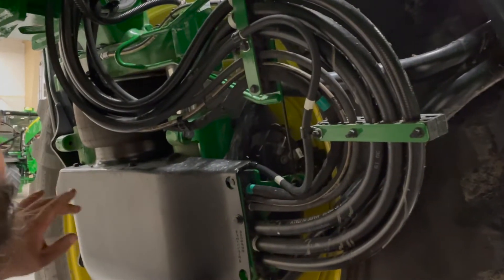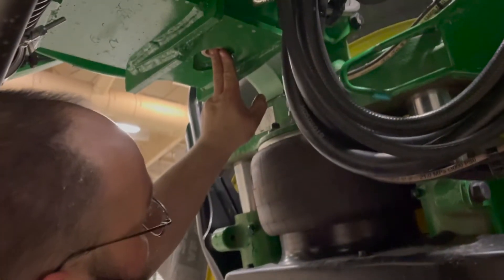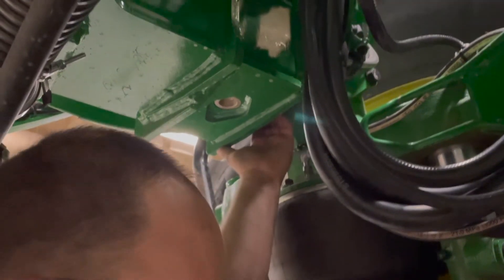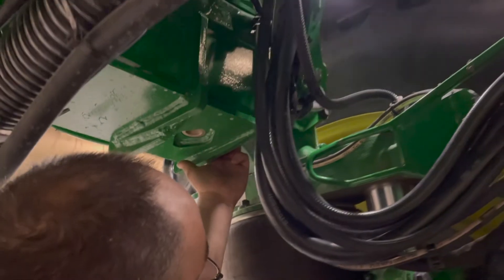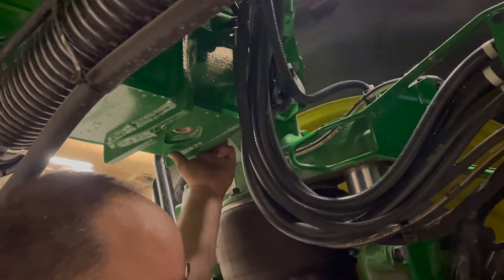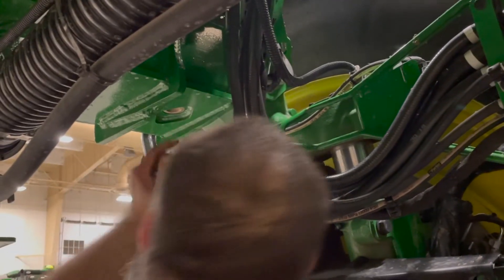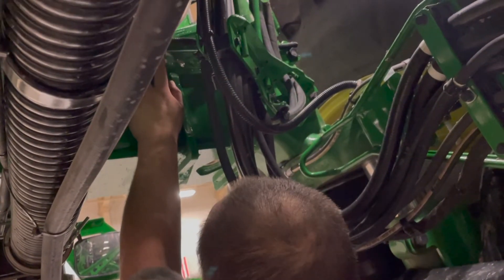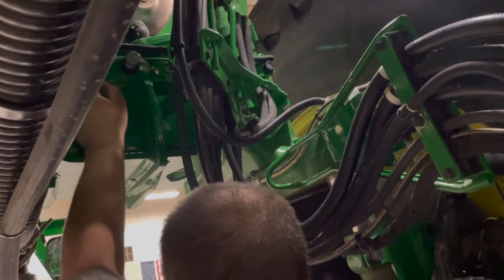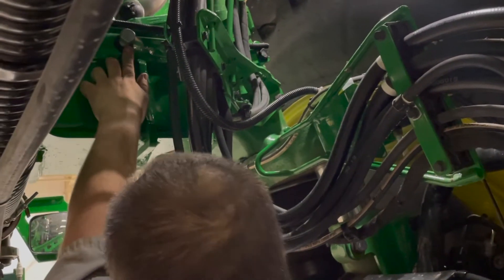A 250-hour service on this machine would be to check your shim gap. If you can pick up on the brass pad, it is loose. You should have a 60-thousandths gap between your axle and that shim pad. The book recommends running the tread up to 140 inches and jacking the machine off the ground. To properly tighten it, loosen these three nuts and torque these bolts until they hold 185 foot-pounds of torque, then back each bolt off an eighth of a turn and tighten the jam nuts back down.